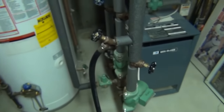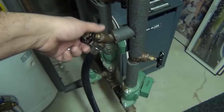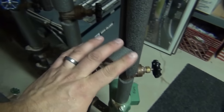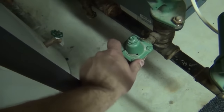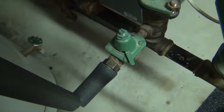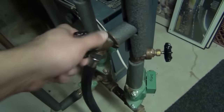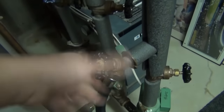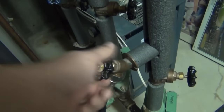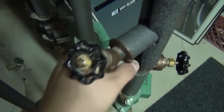Checking the bucket — I don't see any more air coming out, so we're going to shut this purge valve off. Before you shut it, go back down to your fill valve and return it to the normal position — I can't stress enough how important that is. Once the fill valve is back to its normal position, go ahead and shut the purge valve off. Then we move over to the next zone.